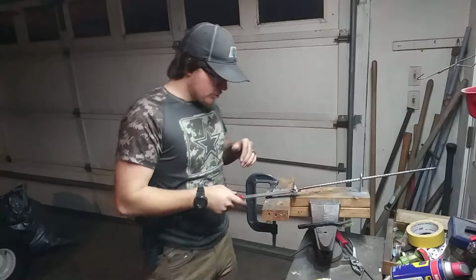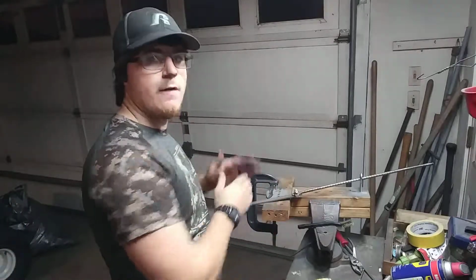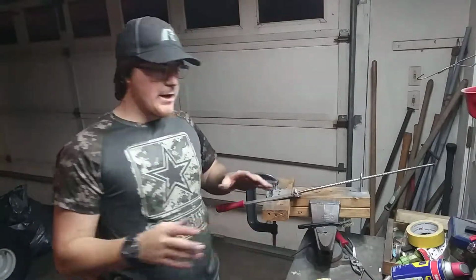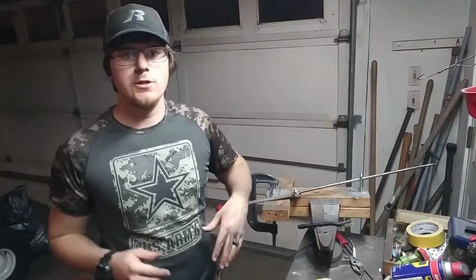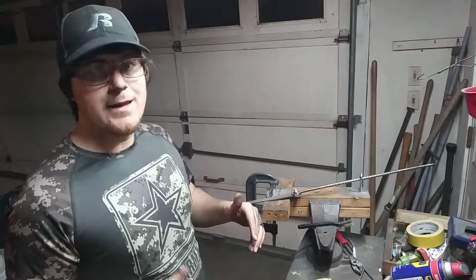Alright guys, just about finished with this bevel. I'm going to go ahead and continue working on it. I'm not going to be able to get both of them done tonight. The next video on this knife will be the sanding and wet sanding process, getting it all finished up, getting the satin finish. And I think here soon I'm going to get me a gallon of ferric chloride, and I'm going to try and do a dark acid wash on these, and I might do a stone wash on them as well.